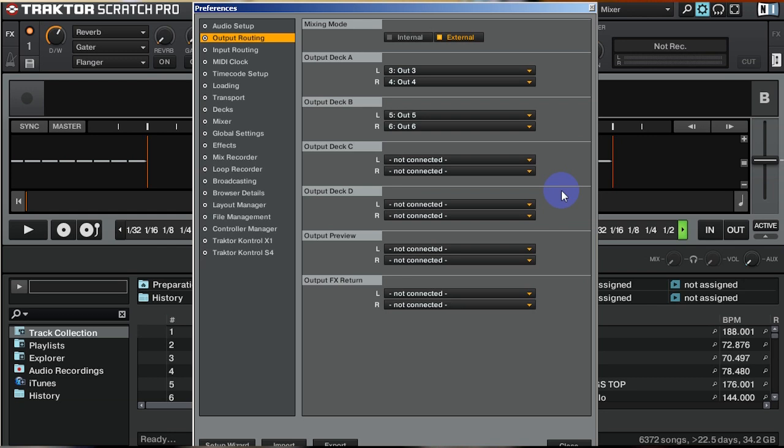All of your audio is sent through the VMS4. So if you want to plug your VMS4 into a stereo that has a mini jack, you need to get a left and right male RCA to male 3.5 millimeter jack, also known as a mini jack.